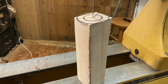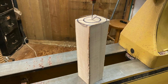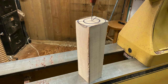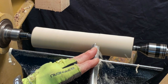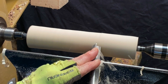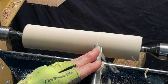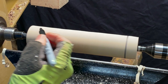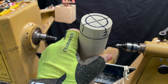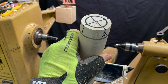The first thing I do is take a rectangular piece of wood — I love green wood — cut it on the bandsaw, and find the center. I use the plastic from the tops of yogurt containers; I can find angles easily that way. I'll mount it on the lathe and turn it into a cylinder using my bowl gouge. Then I'll use a magic marker so I can see my lines, and I'll mark about a half inch from each end so I can make notes to myself and see where the axes are.